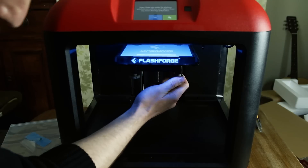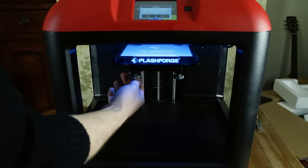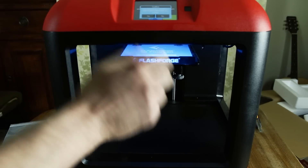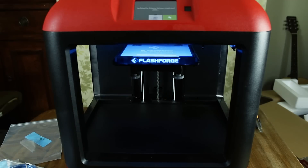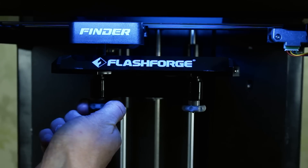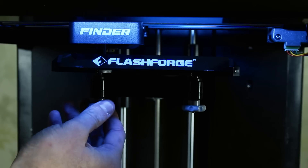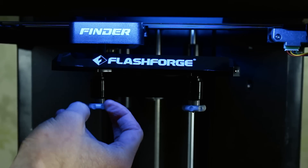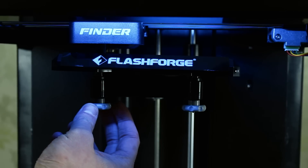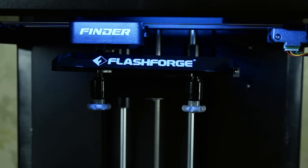So we've got three. Press OK. Make sure you can't finger tighten any of these nuts anymore. I can, but it's making a horrible noise. I can do that one a little bit more. I think that's enough. So it says verifying the distance between the nozzle and the plate. Now it's asking me to unscrew this until I hear a beep. It's going to ask me to go through all of these screws until it's ready, but we'll skip past that.